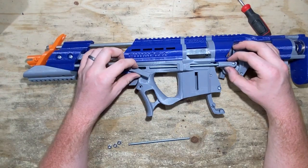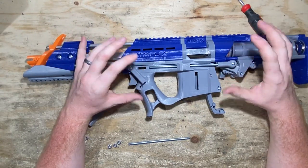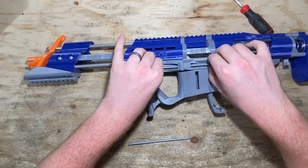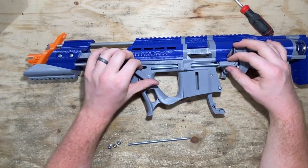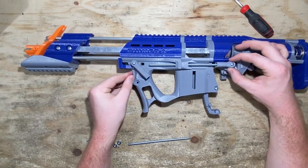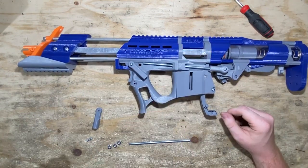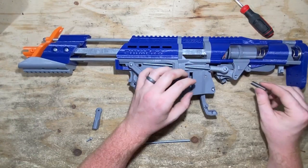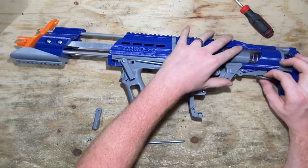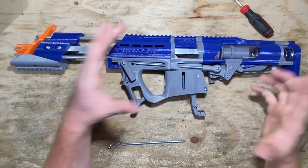As you can tell, when we bring this guy over — this is kind of hard to explain, I'll try my best — we need to basically distance things either by screwing the threaded rod in further to make more room, or loosening it to make it tighter. That way, when we pull the trigger, it pushes back on this piece and lifts this sear appropriately. To help visualize this, I'm actually going to install the big spring. We're going to hook it around this one and bring it up to the sear. Now we'll see and feel it push back down and find where the neutral spot is.